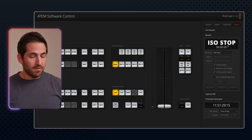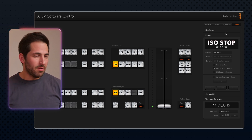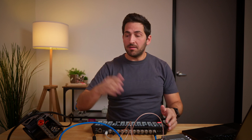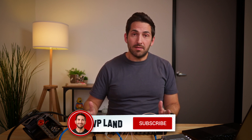One of the really great benefits of this setup was camera control through the ATEM. Since this is the ISO ATEM, we could record isolated inputs on a hard drive as a backup. But the really good thing was we could start all cameras in sync and all cameras received the same timecode — using the ATEM as a central clock pushing timecode out to everything. From one spot, we could start recording and have all cameras start recording internally in sync, without worrying about operators forgetting to start their camera. Everything was synced for post-production editing.